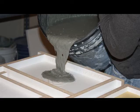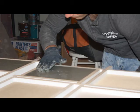A lot of different ways to make the concrete. Typically with dimensional pieces like that big furniture piece over there with the white sink on it, the layer of concrete that you see on the outside was sprayed through a gun, because you can't just cast concrete like that. That piece is not solid, 9 inches. It's actually only 3/4 of an inch all the way around, and it's filled with a very rigid foam. So that was cast completely upside down and in one piece.